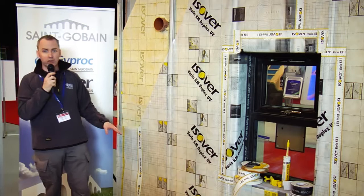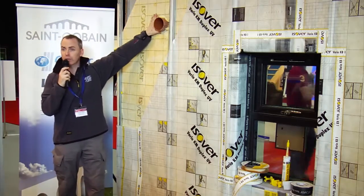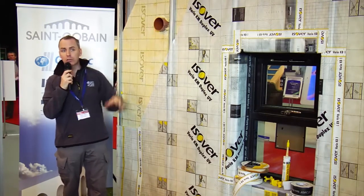You need to pay very close attention to ventilation. While your membrane will come up and seal to your vents so you've got a completely airtight system, you must maintain your vents within the system to make sure you maintain your air quality within the dwelling.